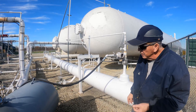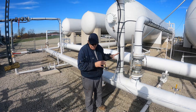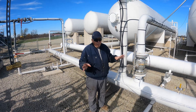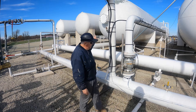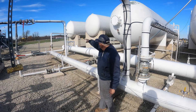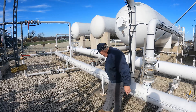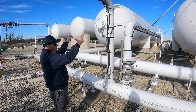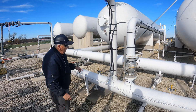I put the pull-off on this end because on the other end, for tanks three and four, the pull-offs go into the tanks — those two tanks are smaller and sit up higher, so their vapor goes right up into them. This is my system specifically, but the principles are the same wherever you go. Here's my main propane vapor coming off the first three tanks, coming into a vapor trunk line. The red handle valve is vapor coming from my very far tank.